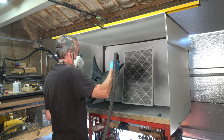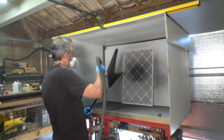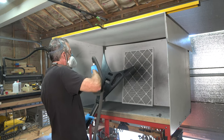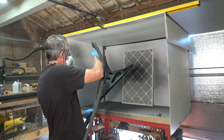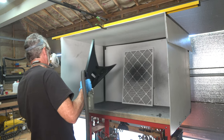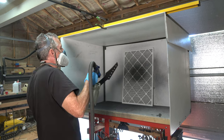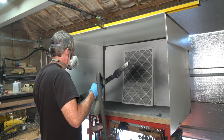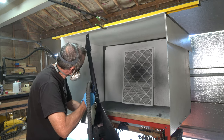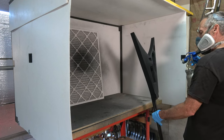When I spray the clear coat, sometimes I have no choice but to thin it depending on the atmospheric conditions. I always test on scrap first to make sure I have everything adjusted correctly and the right viscosity so it's not splattering. I'll apply each coat about 20 to 30 minutes apart. After each coat dries I'll inspect the surface — if I see any dust specks or texture I can do a little level sanding, especially approaching the final coats. My goal is that the last coat goes down as smooth as possible, so I may spray more than the normal five coats to make sure that final coat is absolutely perfect with no dust specs, no texture.